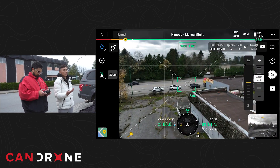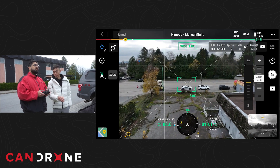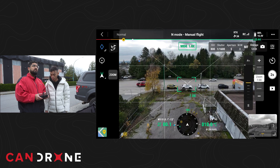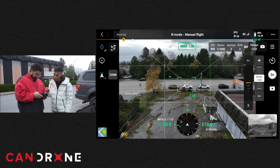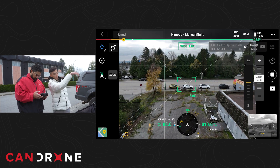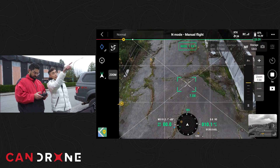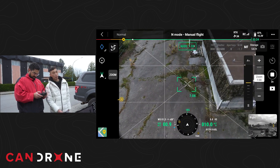What you're going to do is fly as if you're painting the scene — similar idea to using lidar. It doesn't have to be perfect. Hit the shutter button on the right side for a 2-second interval, so it's going to take a photo every two seconds. Aim the camera down at the building and go side to side. Start at altitude and just go slowly — keep going until you cover the whole entire side of the building. We're just manually mapping at this point.